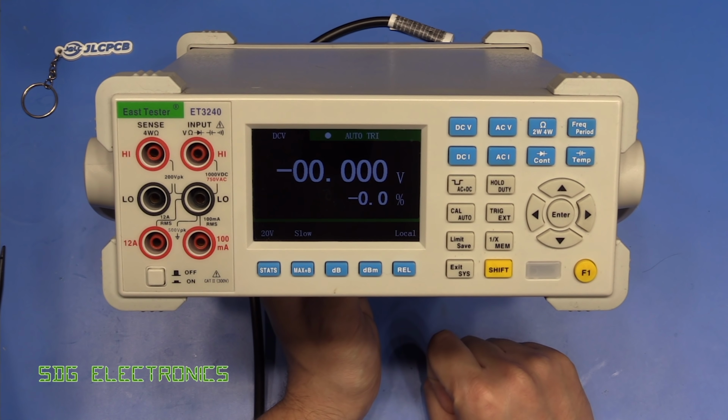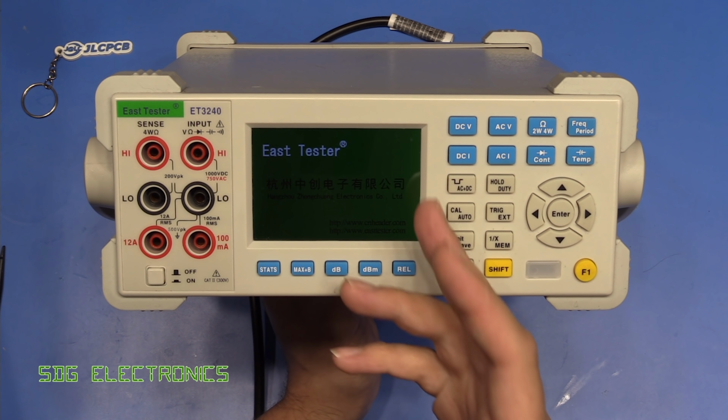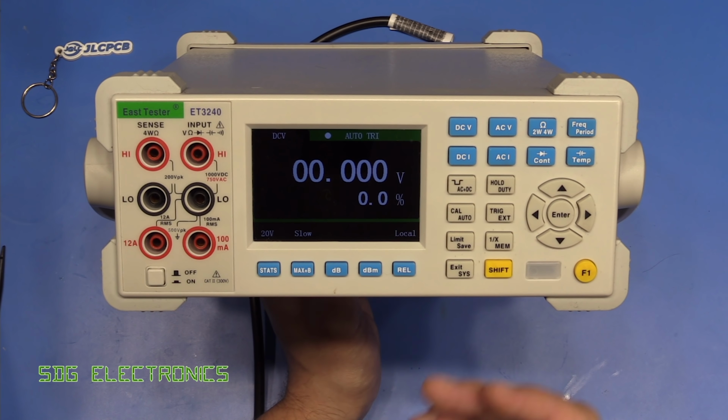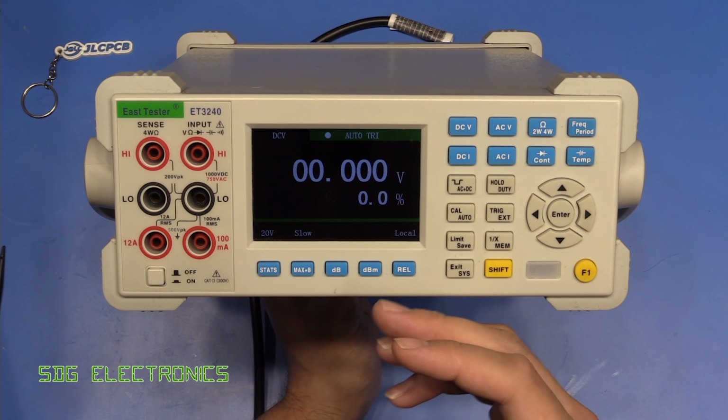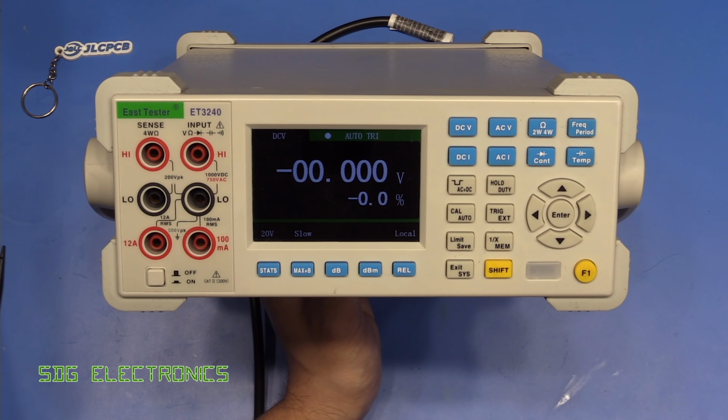Another thing to note is that you probably won't be able to pick up this type of fault with a standard multimeter. You can see the flickering, in fact it's rebooted now, but the flickering is relatively high frequency, and a standard multimeter will actually average over quite a long period, so you might not see these little transients. With a scope you might be able to, or with an LED, just probing different points, you'll be able to see the flickering occurring on the LED, but with a multimeter we might not be able to.